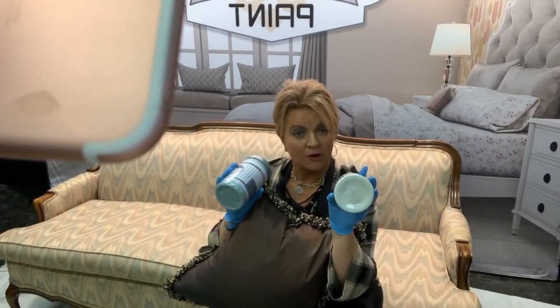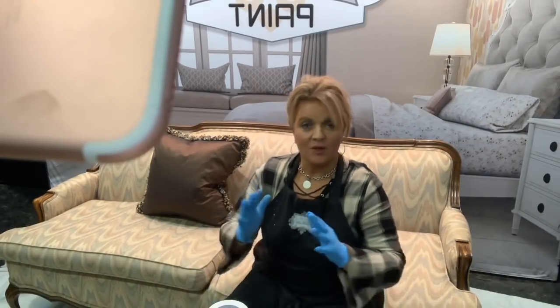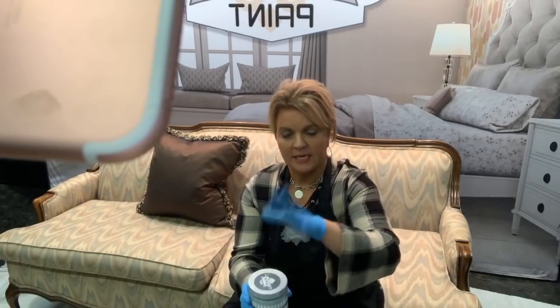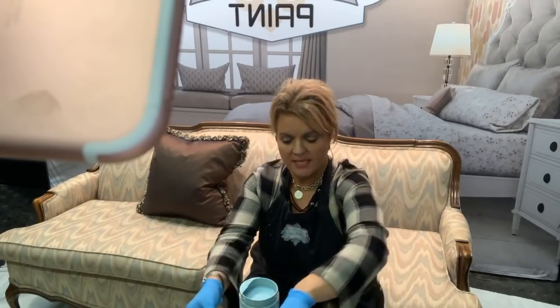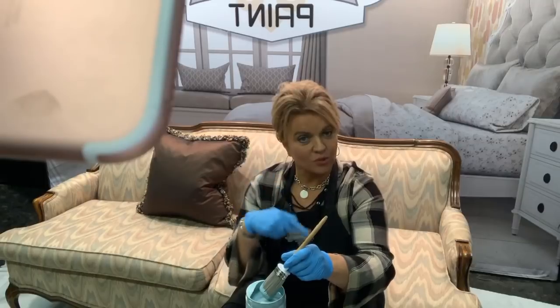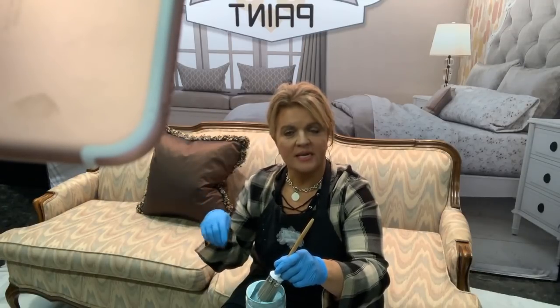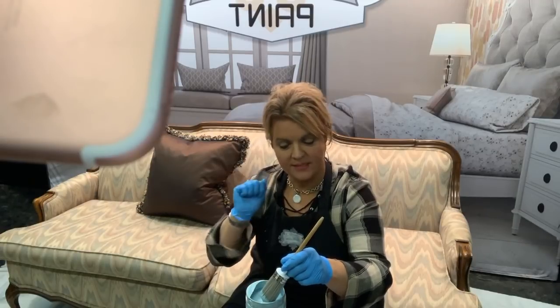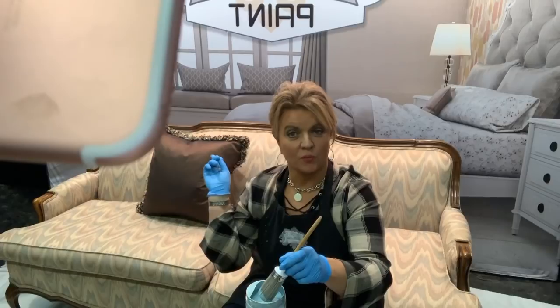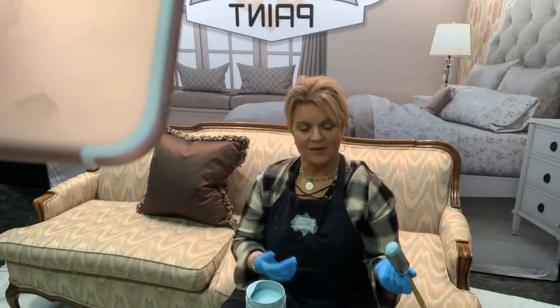So I'm going to set the pillows on this gorgeous faded green. I'll do the trim around the sofa in Farmhouse, which is a kind of sedate white — that's going to give us a beautiful French feel. These cushions are removable, so it requires painting both sides to make it look authentic. The way to approach it: get one good coat of trim color on the wood first, then put on your fabric paint, then go back with a second coat on the wood, and cut in your last coat of fabric paint.